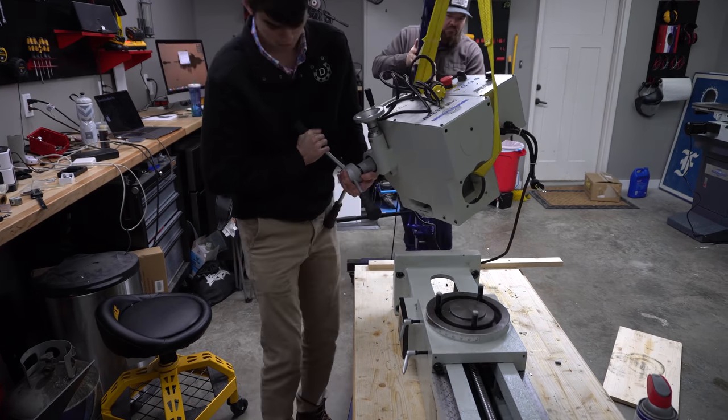Inside of the box, we have a 72 volt, 20 amp, unregulated DC power supply. The reason I went with an unregulated power supply over a regulated one was mostly because of cost. Unregulated power supplies can also soak up current feedback, such as when a stepper motor is slowing down without faulting. In fact, unregulated DC power supplies will never fault. If you draw too much power, their transformer will burn up. If you're just learning the ropes, I would stay away from the unregulated power supplies.